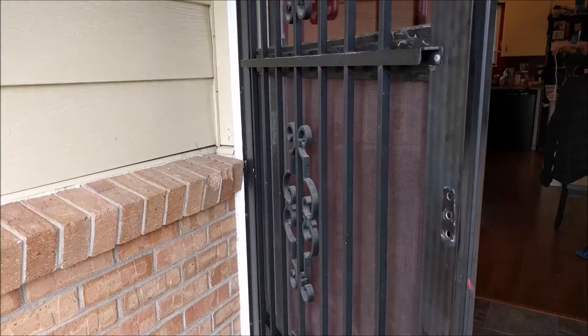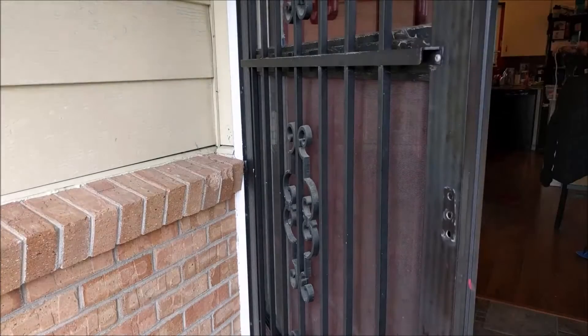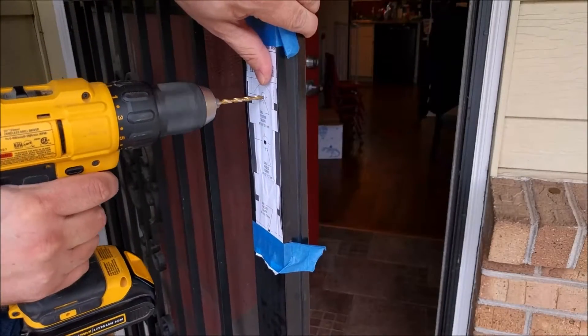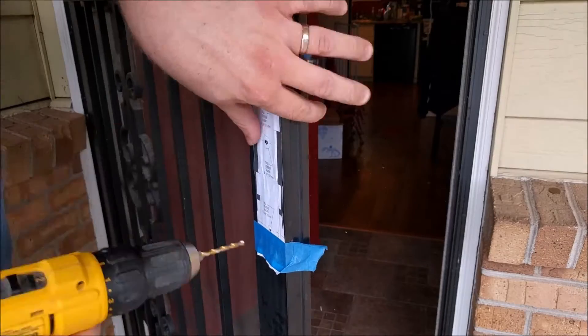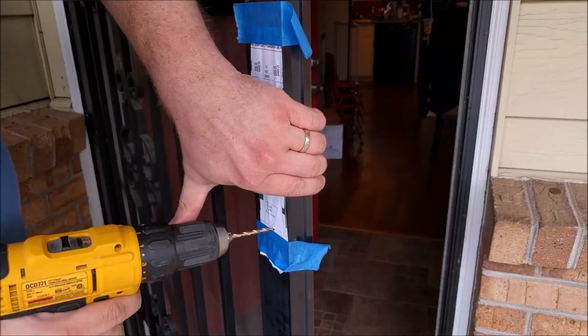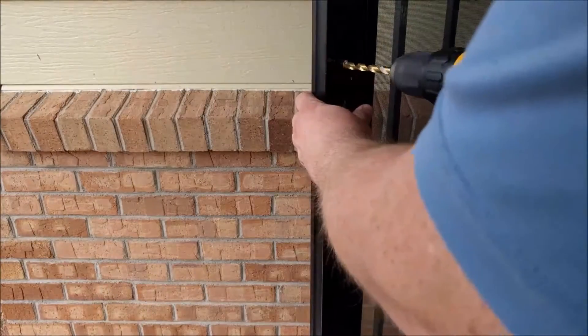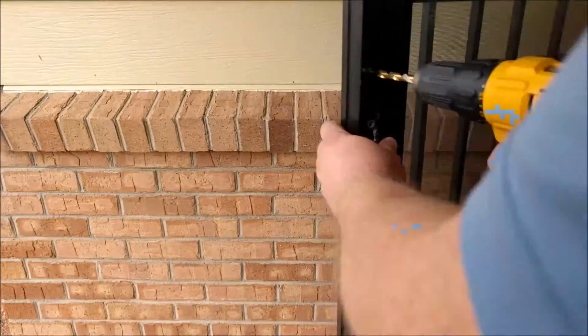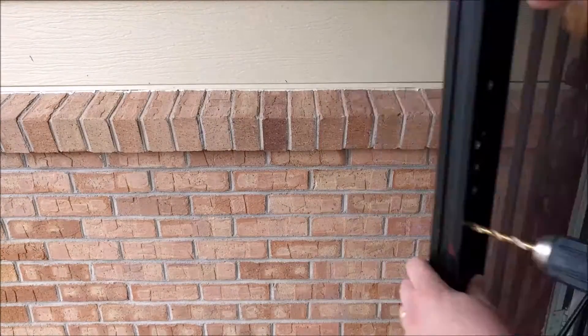This makes it so you can get much better positioning of the bigger drill bits, since those tend to walk. When you move the template to the second side, you want to make sure it's at the exact same height as it was on the first side, otherwise your holes won't line up and it won't work. By drilling the pilot hole on both sides, your hole will be perfect going through. You break through the first side, line it up, and then drill through the second side.